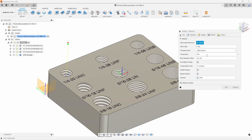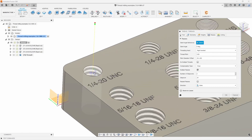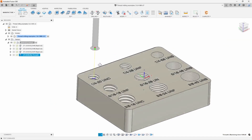At this point we're almost ready to go. Some of the other default parameters I don't need to mess with too much, unless we wanted to add wear offsets so we can make the hole bigger from the controller. We can also add multiple passes if we didn't want to take all of that in one pass — let's put in about 10 thousandths for two passes. We can also add a repeat finishing pass so the tool comes back in and cleans up the hole. In the linking parameters there's really nothing much we need to do unless you have a specific reason to change the entry motion. So I'll go ahead and hit OK.